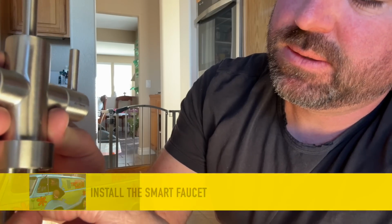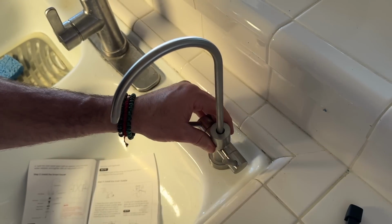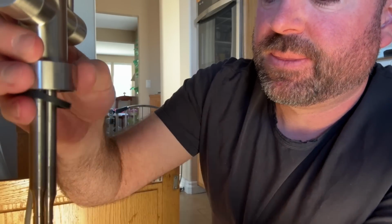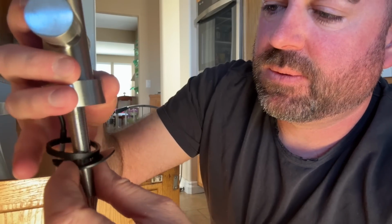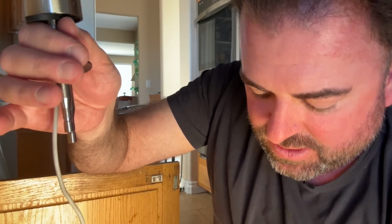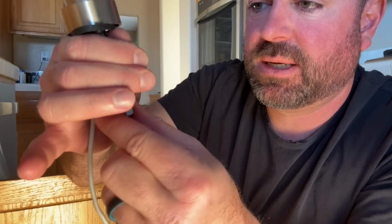The rubber seal right here. It's gonna go here, then it's gonna come through your porcelain sink or your sink. So then underneath this sink part, see this is your sink, you're gonna pass the rubber piece right here. Okay, so this is gonna be up here. This is your sink. I'm just doing this because it's too hard to get under there with it. And then you're gonna put your metal over like that. Then you're gonna take your screws, see that? And you're gonna tighten this up.